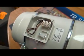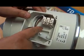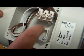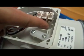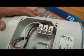When you remove the warning label you will see the neutral being the furthest point to your left, LA being the high speed in the middle, and LB being the furthest point to your right. You will notice that the LB is blanked off, because in most cases your fan runs on the high speed.